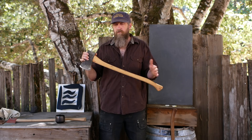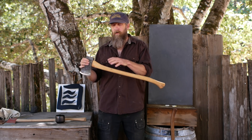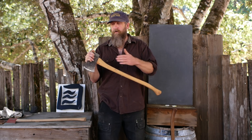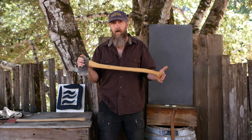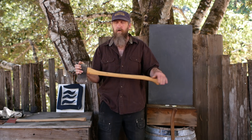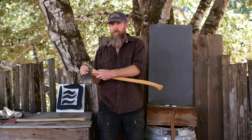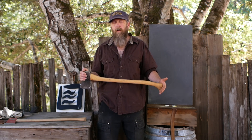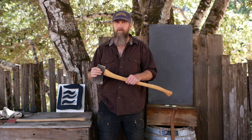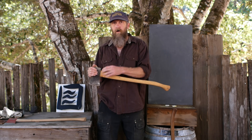With this tool we have two very dissimilar materials joined together. We have a very hard material that doesn't flex and has high mass, and then we have a low-mass material that's much more flexible, although much weaker. Joining these two very dissimilar materials creates inherent problems. This material is much harder and less flexible, so if I bend this handle against this hard edge at the eye, that stacks up stress there and makes a point that's essentially vulnerable. If I have any given axe head and want to put a handle on it, there are two things I'm probably not going to change: the weight of the axe and the size and shape of the eye. The size and shape of the eye are fixed.